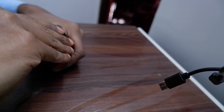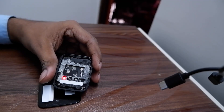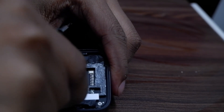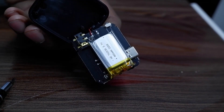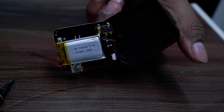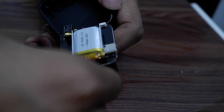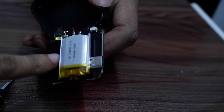Now I'm going to open this mic and see what is inside. Here you can see a small electrical circuit board, a battery, and an LED. There is an audio processing circuit — basically a microprocessor. If you are not comfortable with reassembling electronic gadgets, do not open it. On the inside back side you can see a 3.7V 400 milliampere battery in both the transmitter and receiver.